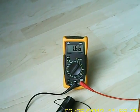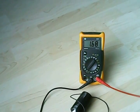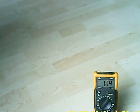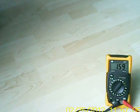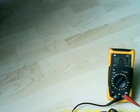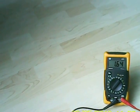1.8. 1.6. It doesn't have a really high internal resistance, meaning it's not going to take a charge easily — because you do need to have some resistance in there. As my super caps are draining, I am more confident to give the boost to the cell for a longer period of time, because you are not going to blow up these batteries with lower voltage like it is now — it's about 1.6 volts. I am not going to blow up any batteries with it. So I can keep it on there for 10 seconds, 20 seconds. And I am actually feeling if it's getting warm or not, because it will get warm. Not yet.